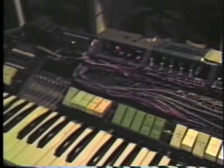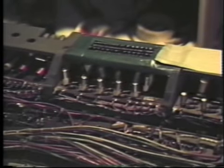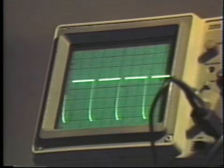So what is the secret of Farfisa? Why does it sound that way? What the hell were they thinking when they designed it? So we're about to look at the output of one of these generator cards on the oscilloscope. What you're seeing right now are the raw generator outputs for one note. Each card — there are 12 cards, one for each note — and each one gives you four or five harmonics. It's much the same as any other organ, but instead of giving you lame-ass square sine waves like every other organ, Farfisa gives you these weird pulse waves, because instead of using flip-flop circuits, they used non-retriggering monostable multivibrator circuits.